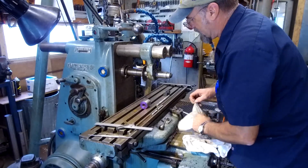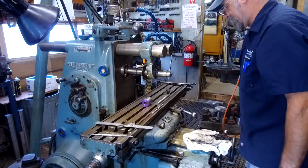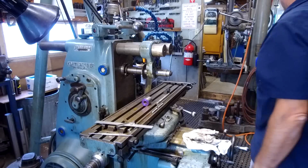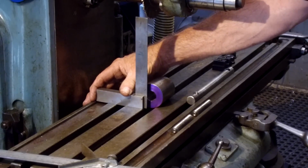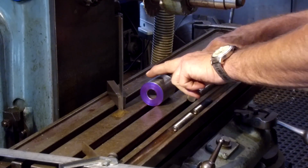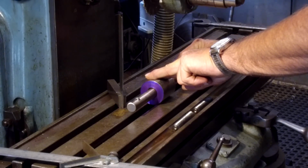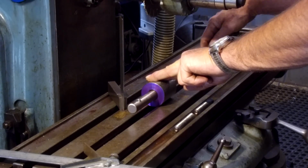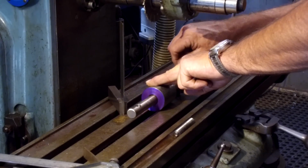Okay, we can run it in the center groove. We're going to go ahead and run it in there. We're going to bring things up and get them square and tighten down. All right, that'll be the next step. Okay, we come in and we eyeball that so that we are square. Then we hold that down firm and we slide in our bar here, and we're going to make it equal both directions there. We're going to slide our T-nuts in here while we're holding pressure down on there so we know it doesn't rotate.